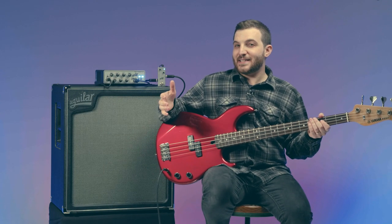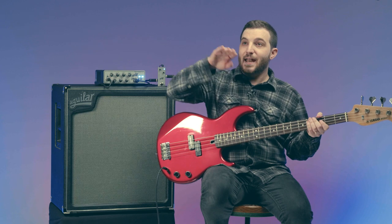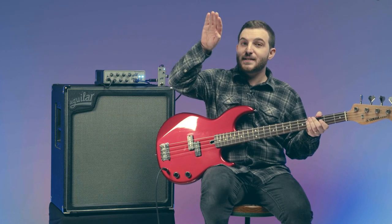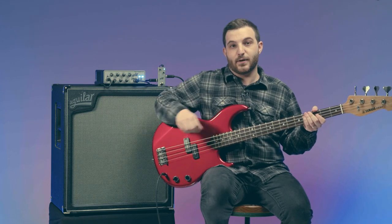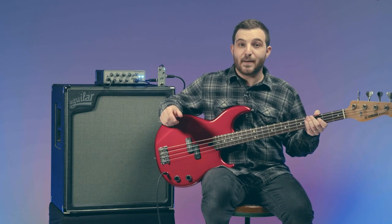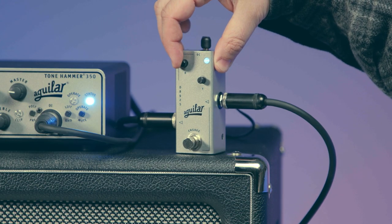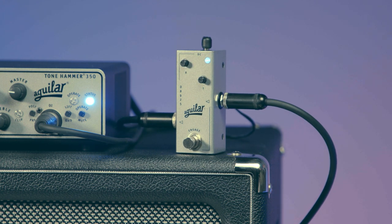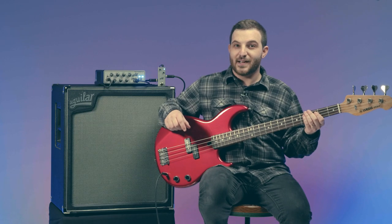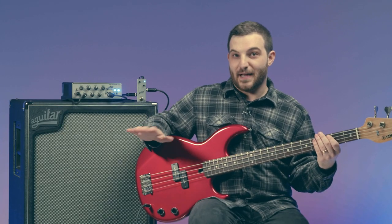Finally, you might notice that the DB925 does not have a midrange control. With broadband boost, as you boost bass, there's a slope that develops going through the bass frequencies into the low mid frequencies — same with the treble through the high mid frequencies. So as you boost bass, you're also boosting those mids, but to a lower degree. If you boost both bass and treble, what you develop is a midrange scoop, which although there's still midrange content there, it's to a lesser degree — and this is a fantastic sound for slap bass.